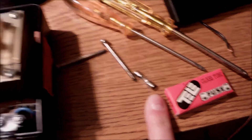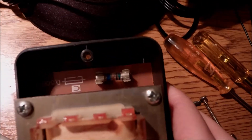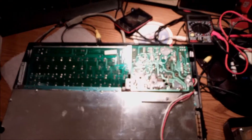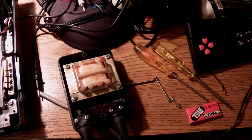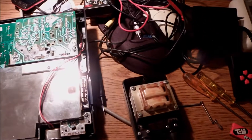I have some spares here. This one is the old one, and there's an empty space right there which is 0.2 amps, and there is another one which is 0.5. I'm going to replace both so I can make sure they are brand new. Whenever you have to deal with something that old, before you do anything just check the power adapter, check the voltage, so as not to fry anything, and make sure you have some spare fuses.